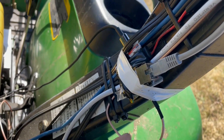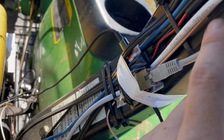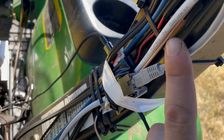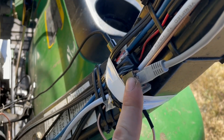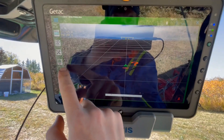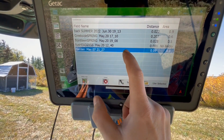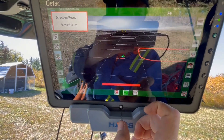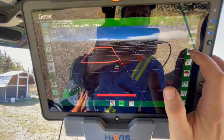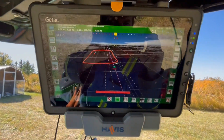Here's my new micro GPS system. I've got just a SparkFun board and one Ethernet TTL adapter, and then it goes to UDP — I'm still powering it off USB. I'm learning about PoE, so the idea would be power coming over Ethernet to power the whole unit up with one more little circuit board, and then the antenna directly attached on top of the tractor. I hit the button, open, guard, and select it. There we go — I've got the garden loaded, now I should be on the same lines. I've got all my garden lines set up, so I shouldn't have to drive.